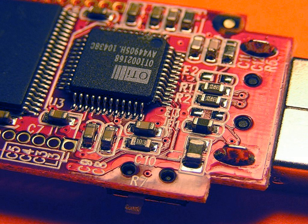Discrete semiconductors. Discrete semiconductors, such as diodes and transistors, are often marked with a 2- or 3-symbol code. The same code marked on different packages or on devices from different manufacturers can translate to different devices. Many of these codes, used because the devices are too small to be marked with more traditional numbers used on larger packages, correlate to more familiar traditional part numbers when a correlation list is consulted. GM4PMK in the United Kingdom has prepared a correlation list, and a similar .pdf list is also available, although these lists are not complete.